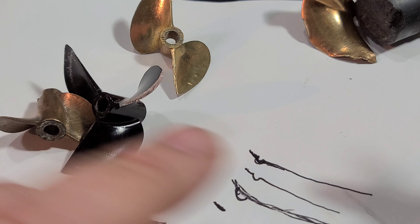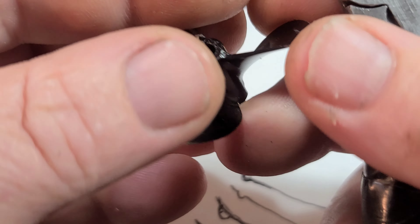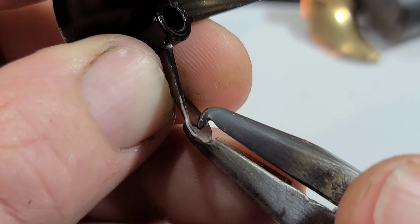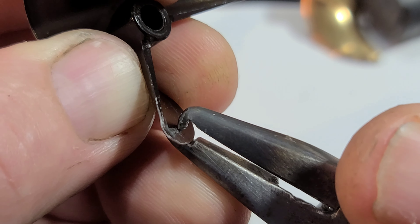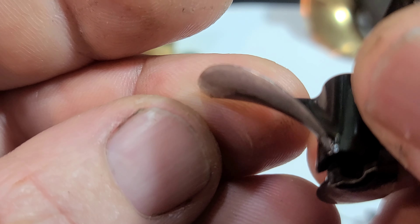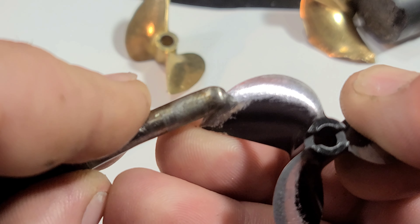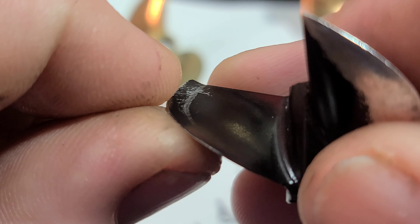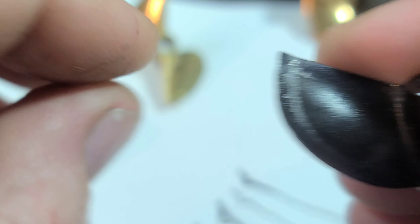These pliers I've really only tested on aluminum props, which aren't the best, but you grab it and give it some pressure — you guys see that? It's doing what I hoped it would do. You see that little indention right there? I want that. You see where the anodize is knocked off — it looks like it's scratching the prop, and it is scratching the anodize off, but it's leaving a little groove, and that's what I'm going for.